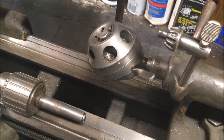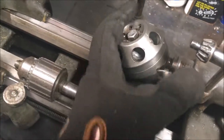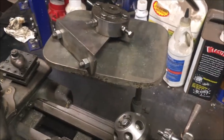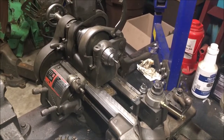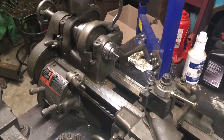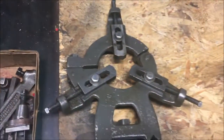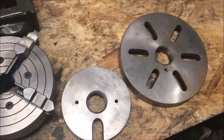This is another cool attachment — it's actually a Jacobs indexing six-position, so you can put center drills, drills, taps, whatever in there. There are a couple of chucks; I believe this stand is original. I have the collet system in right now, which has the spindle thread protector nut, and there's a pretty good collection of original South Bend collets. The original lantern style tool post is there, a South Bend steady rest, a four jaw chuck which is also South Bend, and two different size drive plates.